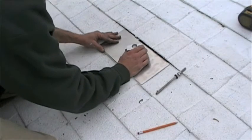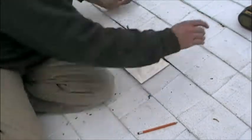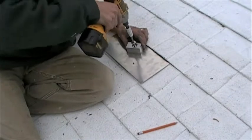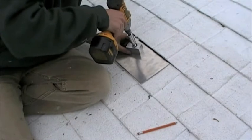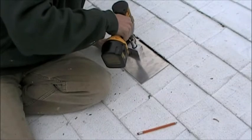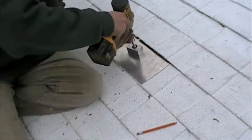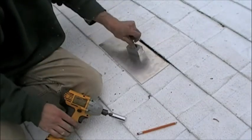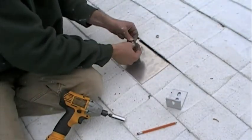As you can see, I've already attached my combination rubber gasket metal washer. Both the gasket and the silicon will ensure that no water can penetrate through the roof. As it tightens, I turn the block on an angle so that water will not build up behind it. As a redundant safety measure, we add a second rubber gasket.